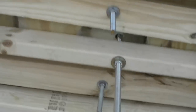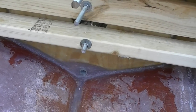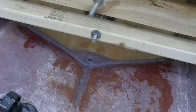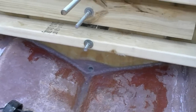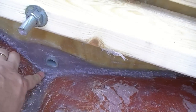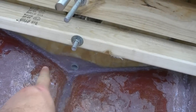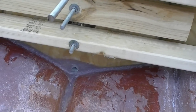Wow, it's been about two hours. I tell you, this stuff kicked off quicker than I thought it was going to. I mixed it at three-quarter percent according to the instructions, and right as we were finishing up it was starting to gel. Sorry I didn't dictate as I should have — but when you're working with stuff that kicks off quick, you move fast. Looks like my little drain hole arrangement worked out pretty good — filled it in with peanut butter really nicely. That'll give us a spot to tab in the transom with 1708, and I'm really happy with how it turned out.